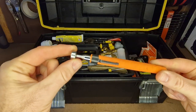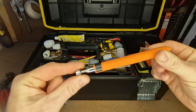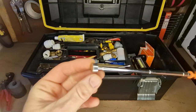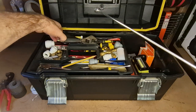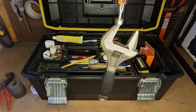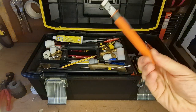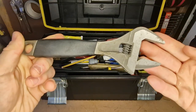Pick-up tool — so useful in a plumbing toolbox. I find this to be the most useful thing to carry. If you drop a small part, screw, bolt or something like that, it can be really hard to retrieve, but with one of these strong magnets I can lift up some pretty heavy items. It's only cheap, hardly costs anything — it's holding up an 8-inch spanner right there with no difficulty. Just pick up a cheap one for a couple of pounds — it might just save your bacon.